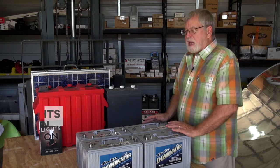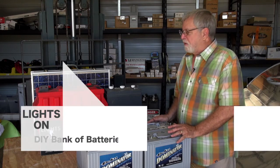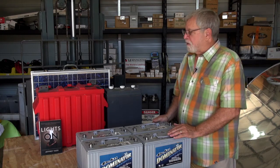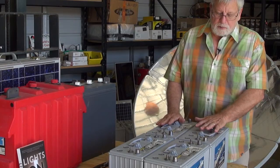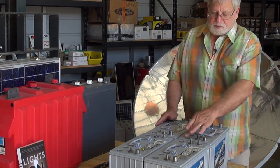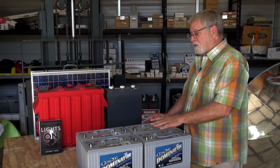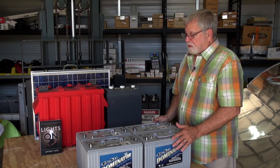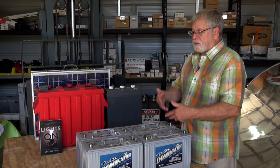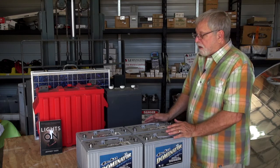In this video I'm going to be talking about batteries you would typically encounter if you were making an off-grid cabin, weekend cabin, or had just a few appliances you wanted to power from a solar system or a backup power system. These are sealed batteries — AGM batteries. They're sealed, you cannot remove the caps, you can't put water in them, and they're non-spillable. You would typically look for this type of battery in an occupied room where you have some concern over gases given off when a battery is being charged.